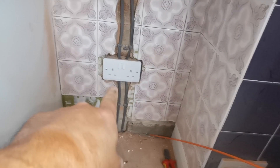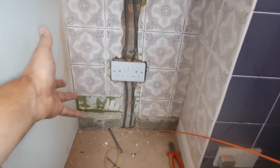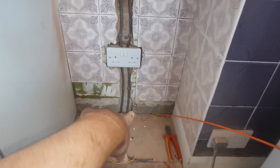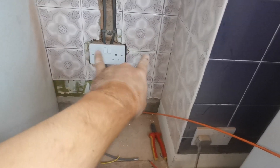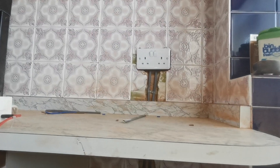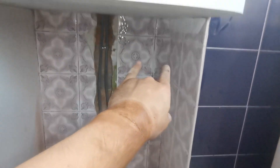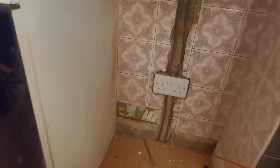Let's talk about cable zones. Every socket creates a zone — this rectangle here creates a zone from side to side where you can run cables. The same applies to sockets on the side and above. Around the edges of a room there's a 6-inch zone where you can run cables — you can fully channel cables anywhere there and they're allowed to be. Out of zone is a no-no. The top 6 inches of a room is a zone as well, running from the fuse board across.